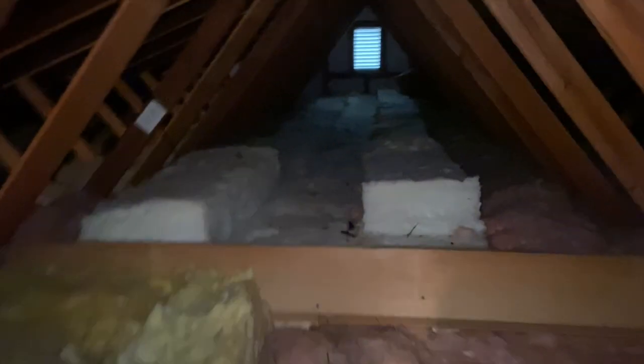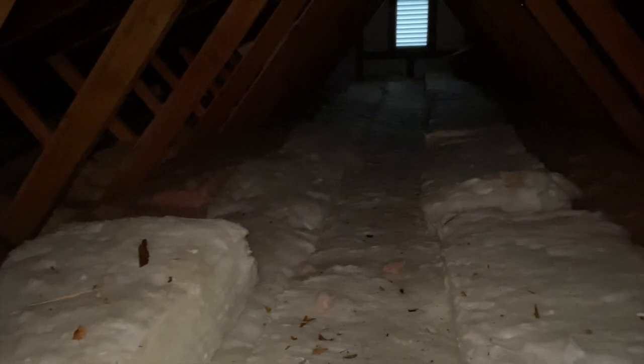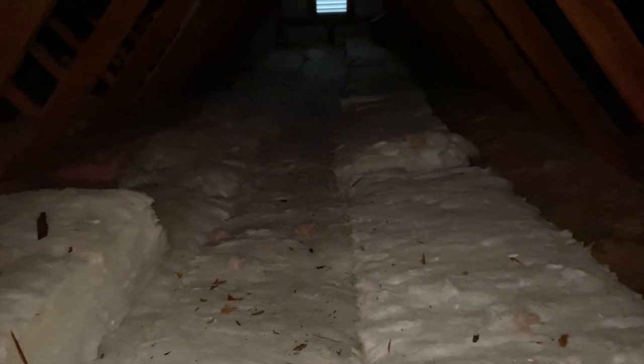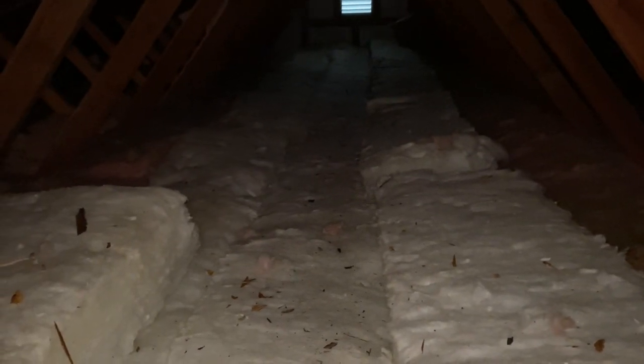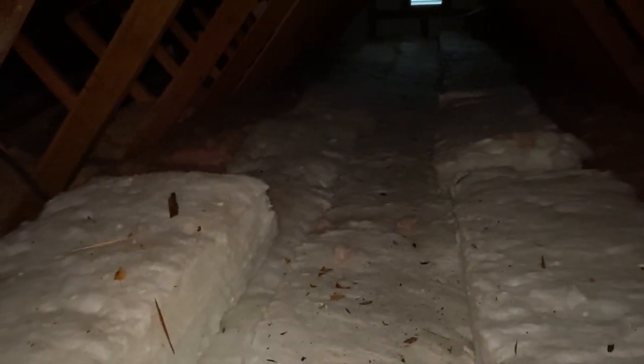You can also get rolled-out insulation, which is a little bit more expensive and a little harder. I put rolled-out insulation in here because I figured there might be stuff I'd have to get to later on, so I bought the real thick stuff and just rolled it all out. Just make sure you don't get faced insulation — that would be insulation that has paper on one side. You want the insulation that is non-faced.